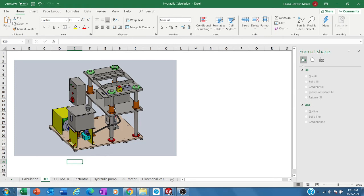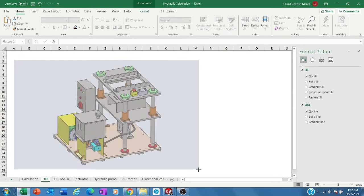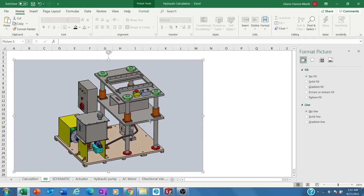as shown in this 3D drawing capture. So this machine, I call it a SMED press machine. SMED is single minute exchange of die, to help the operator or the technician set the mold before installing it on the real machine. It's kind of SMED, because if installing on the real machine directly, it will take more time.